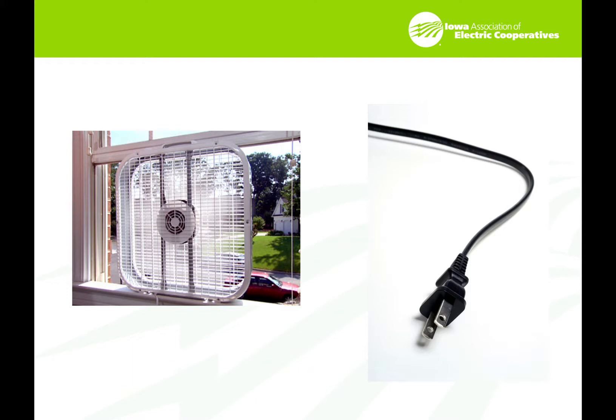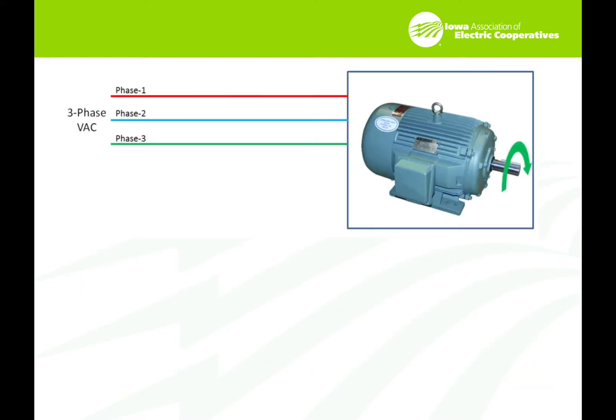Remember as a kid, we had air conditioning in the form of a box fan in a window, plugged into a 110-volt single-phase outlet. I had an erector set as a kid and knew that with a DC battery supply, by reversing the wires, it would reverse all the motors. It always puzzled me that when I unplugged the cord and turned it over and plugged it back in, the fan didn't turn backwards. A single-phase AC motor is wound specifically to turn a specific direction. Three-phase motors are as well, except it's based on the way the power is coming into it — if I reverse two of those wires on a three-phase motor, it'll reverse the motor.